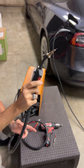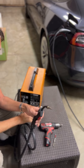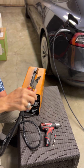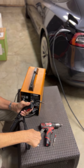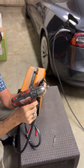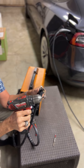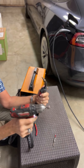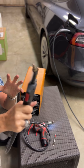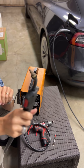Once you've got it unplugged, you can fix this pretty easily. Get some diagonal pliers and cut off any welding wire that's present. Then take some kind of abrasive — you could use a file, a grinding wheel on a drill — and just grind down that tip a little bit. That's going to get rid of any material that's welded together. It may be bad enough that you have to grind down maybe even a 32nd of an inch, but probably just a little bit and you'll be able to free it up.